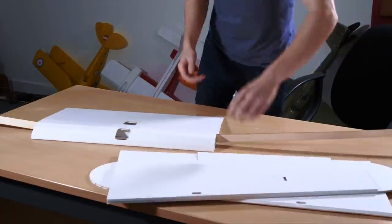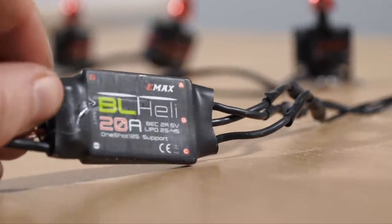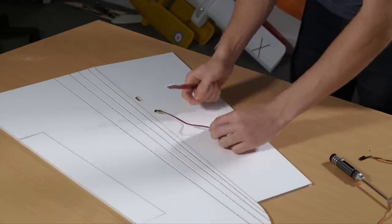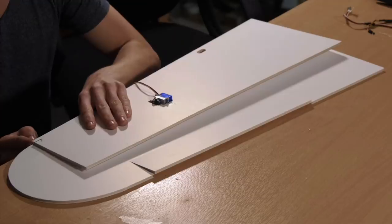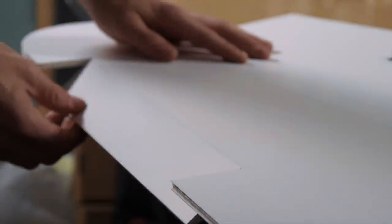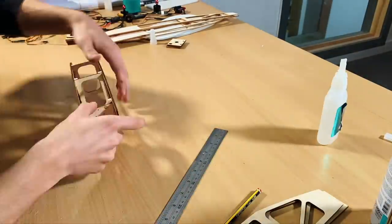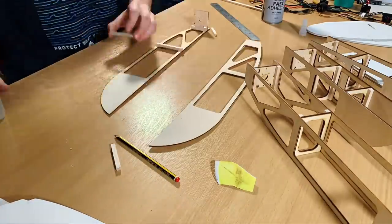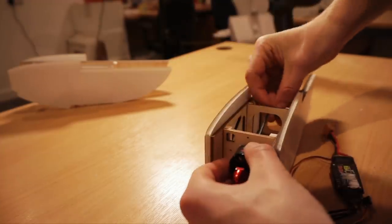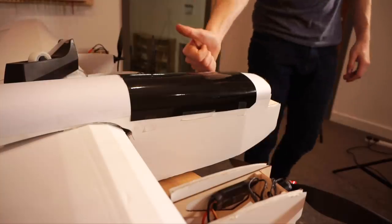After this, I could fold the main wing together and prepare my electronics. This plane recycled four motors and ESCs from an old quadcopter project to keep things affordable. I made sure that the four ESCs could handle four-cell LiPo power to provide around a kilogram of thrust per motor, which would be more than enough for this aircraft. Next, servos could be added to the wings before the outer panels were scored and folded back to provide a nice high-lift airfoil. For each of the engine nacelles, I specifically designed the cores to be made from 3mm plywood to ensure they could stand up to some hefty abuse. As this plane was made without landing gear, the pods had to take on heavy forces from belly landings. After this, I installed the four brushless motors and fixed a skin of lightweight panels to the fuselage top to form a decking. A simple but effective hatch was taped to the nose for access to the main battery, and the control surfaces were all connected up.